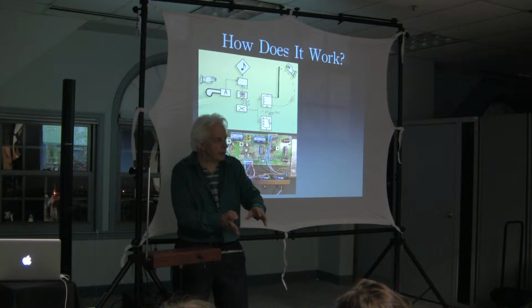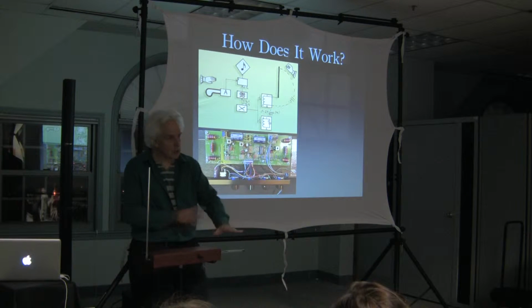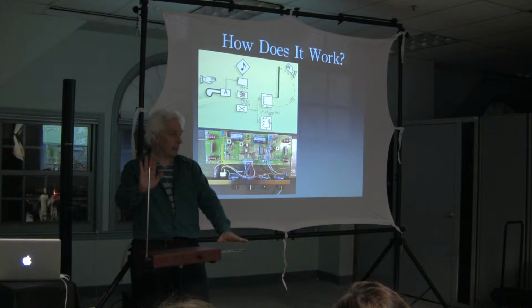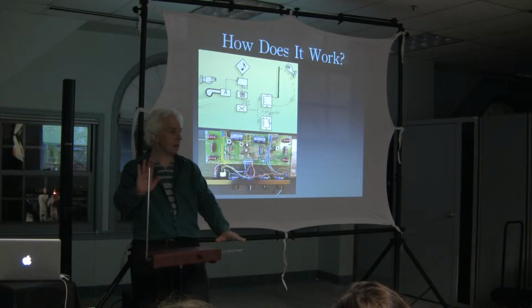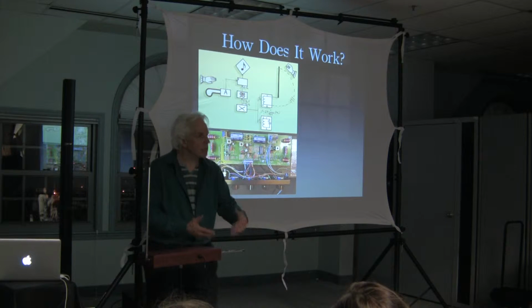The electromagnetic field, and my hand acts as a capacitor for the electricity. The closer I am to the loop, the softer the sound will be until there's none. As I lift my hand, it gets louder. So the further away I am, the louder it is, and the closer I am to the antenna, the softer it is. It opens and closes a volume circuit.